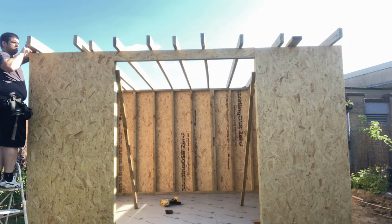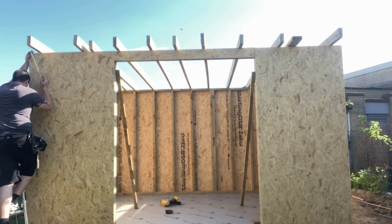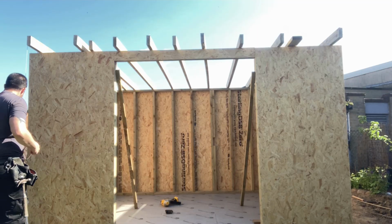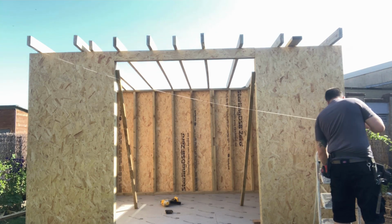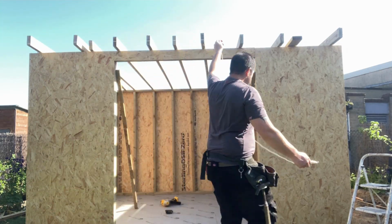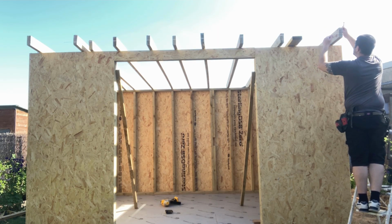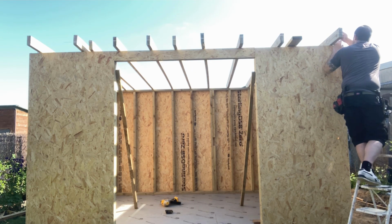Another thing to point out here as well is you should always make sure that the joists, when you're fitting them, or at least when you're putting them up, you try and put any curves or bows to the top of the joists. This is best practice, and it'll also stop the ends being uneven when you put your front timber on. If you've got them with the bow to the bottom and the bow to the top, and they're not even, you'll often find that the front of the joist doesn't line up very well, and then you've got to pack them up and mess around with them, and it can affect your ceiling and cause you all kinds of other problems. So just always have a little look down the timber and make sure any bellies and bows and stuff like that are to the top of the timber.